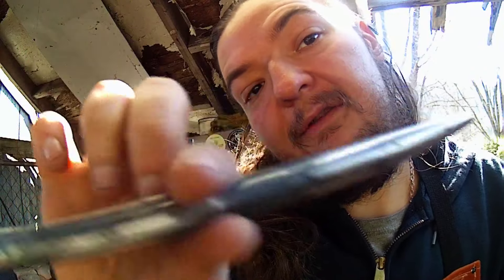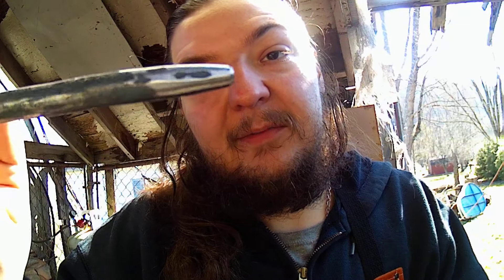So I'm going to heat treat this, I'm going to harden it. We're going to do a differential hardening — I'm going to just quench off this end, our working end here. Scratch it off with a grinding wheel or a file real quick just to get the gunk off, and then watch our colors run up. Once that happens, we're just going to cool off our striking end a bit, and we're going to leave that end soft. Some people don't heat treat any of these because they say it's going to get hot anyway whenever you're punching it. But I like to heat treat them anyway — that way our midsection stays a little tougher and it doesn't bend all over the place. I'd like to do it — it's up to you, ultimately your choice. So we'll get this thermal cycled a couple times here and then we'll be back right before I harden it.